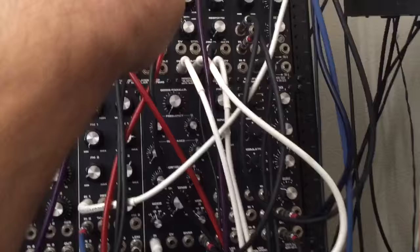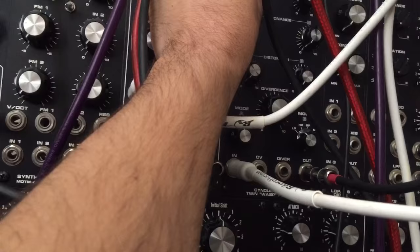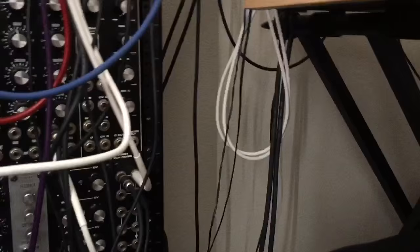Another thing you can do — and I mentioned I would show this — is in the feedback loop, from the sound coming out with the high end being rolled off, you can actually run a high pass filter on the signal you feed back in, to make it so the signal that goes back into the tape echo doesn't get boomy.